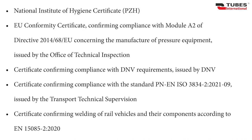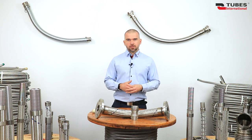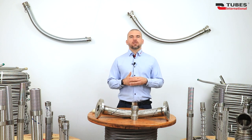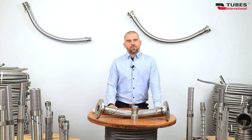It is worth noting that we hold a series of welding certifications. Metal pressure hoses have a fairly wide range of working pressures — from a few bar for the largest diameters to almost 400 bar for hoses with small diameters. When using steel hoses, remember that the working pressure value is influenced by temperature, dynamic work characteristics, and the working pressure of the fittings themselves. High flow rates cause turbulent flow, which can cause vibration in the corrugated hose tube, creating noise and leading to resonance and premature hose failure.